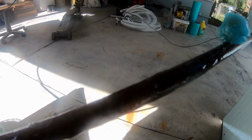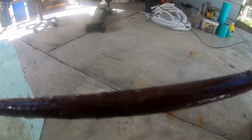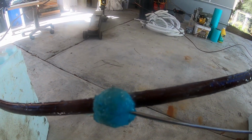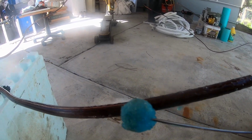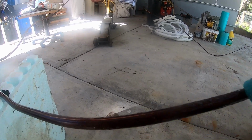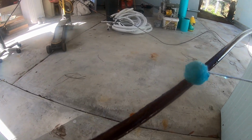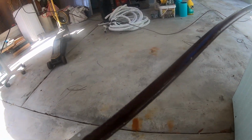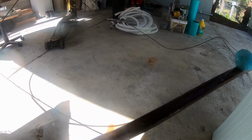I've got 135 more feet of that inside my house that I've got to go tear out. The one line set that's not leaking, I don't trust it. I'm not gonna put another 10 ounces in a whole other charge on the system, pay for that, and then turn around and have another one blow out. You have to replace it all. It's not even just one spot.